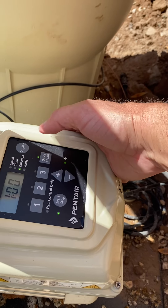Now that we've set our pump, I want to show you a little bit on here. I'm going to set all of these and put labels on them — tell everything what it is. Because there's no automation on this, we're going to set our timers on here for the ozone and the UV. When this is on, the green light should come on to tell you the ozone is on, and this one should have a purple light. During the day in Arizona, it's really hard to see — you've got to cover it up and peek in there to see the purple light.